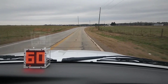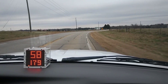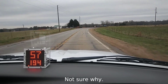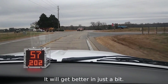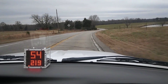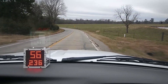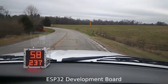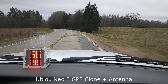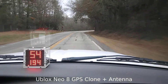I'm riding along here at 60 miles an hour. Now I've got the azimuth up there — I'm going at 57 miles an hour at 194 degrees, which is my course over ground. This is an ESP32 with a Chinese-made supposed-to-be u-blox GPS module — it's not really u-blox, but it works almost like one. We're going into a curvy area so you'll see the course over ground changing a lot.